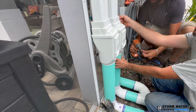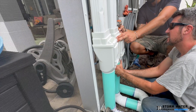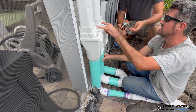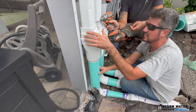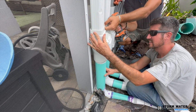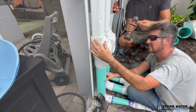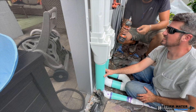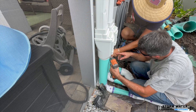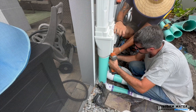If you're a DIYer installing your own PVC drainage system, I'd highly recommend dry fitting it first. I see videos on YouTube where guys just push fittings together without solvent welding — I wouldn't recommend that unless it's a gasketed SDR-35 system with an EPDM rubber gasket. If it's a solvent-welded system, you really should prime it and solvent weld it. That keeps fittings from pushing out over time with ground movement and helps stop root intrusion into the joints.